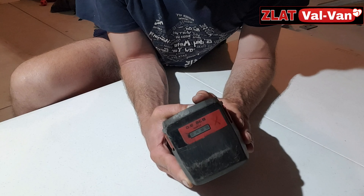My opinion: the 9A batteries are better. They are heavier — double the weight — but it doesn't matter anyway. The job is hard and heavy, so it's even better if the drill is heavier; you don't need to push it into the concrete much, it goes by itself. It depends on what work you do. If you use it all day long every day, I will stick to 9A. If you're only drilling a few holes and not big ones like M20s at 250mm embedment, you can stick to the Nuron new technology.